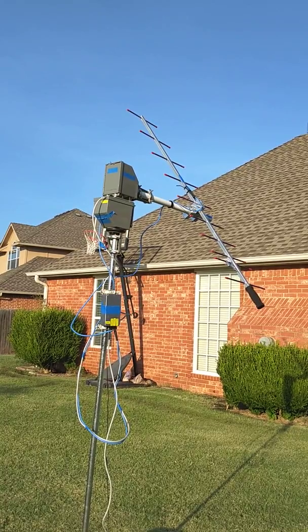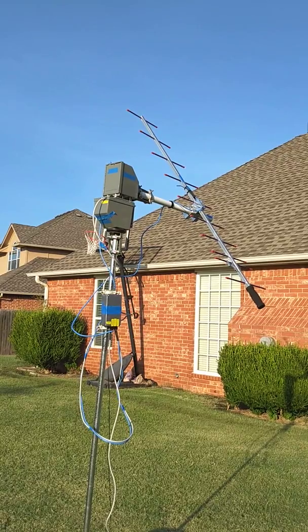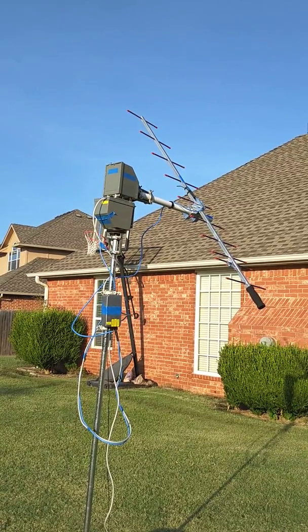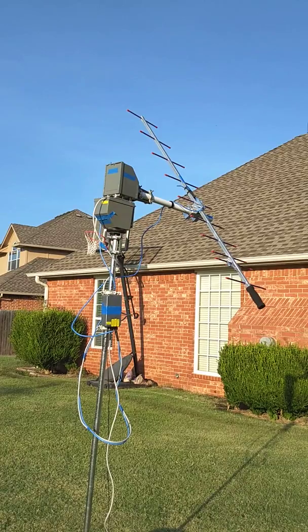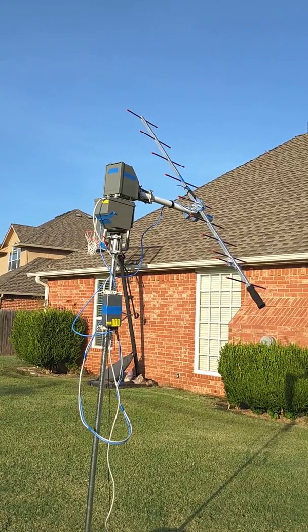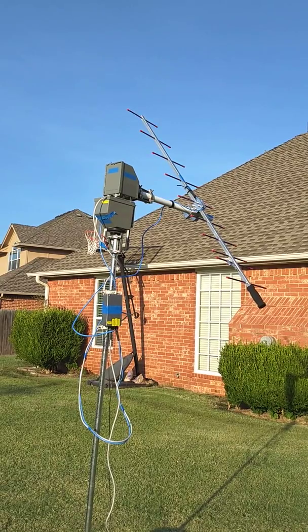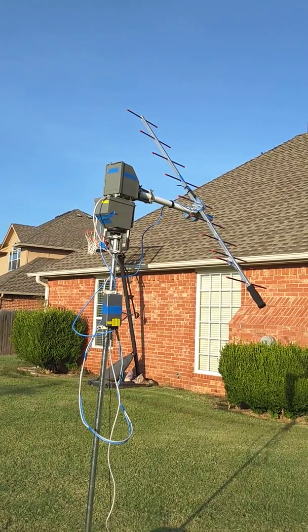Since these are AC motors, they're not stepper motors — you can't count steps. So we just pulsate the motors to nudge them along. If the satellite is quite a ways away and we need a lot more catching up, we widen the pulse width. And when I say 'we,' I mean Joe — Joe did all the programming. I just put this thing together, made some minor changes, and sent reports.